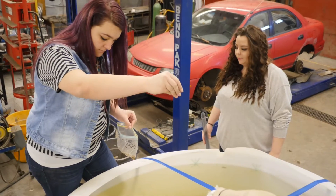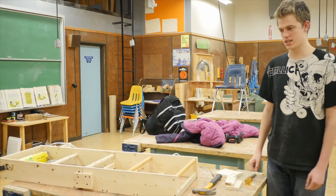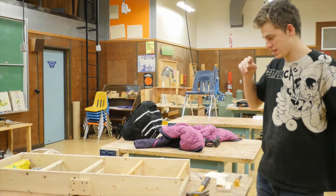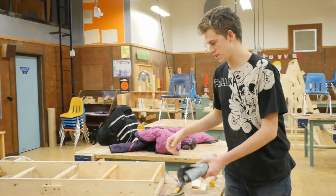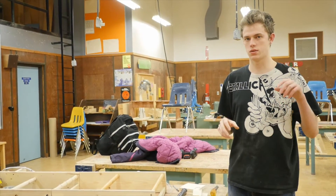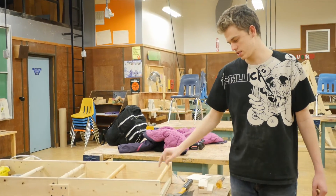Mr. Lee came in and said he needed a different way of feeding the fish than by hand — he wanted an automatic fish feeder. I had a fan motor first on a wooden disc, and that didn't work, so I tried this. It was too short at first because of the speed, so I made it longer. It was supposed to use duct tape, but that was too heavy, so we used plastic wrap — it's kind of like a conveyor belt that wraps around rollers and goes really slowly. Through the day it feeds the fish a little portion, maybe over three hours. The food starts at the back and slowly rolls over and drops into the tank.